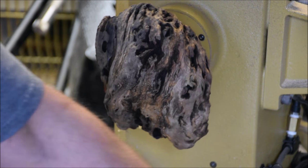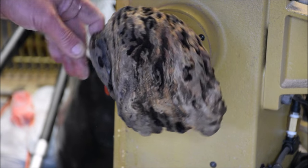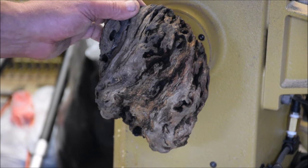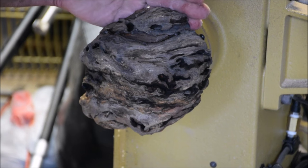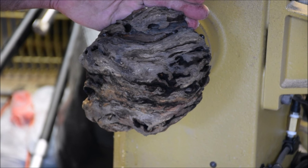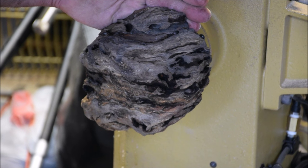All right? Get rid of all this, and that's a good way to handle that. I learned that technique of lighting the denatured alcohol. I had oftentimes used denatured alcohol, but I learned that technique one day watching a Jimmy Clewes video where he raised the grain on some maple using alcohol, which I was already doing, but never had tried putting a torch to it, and it struck me as what a brilliant idea.